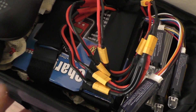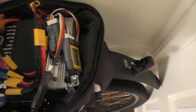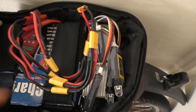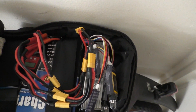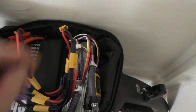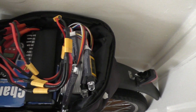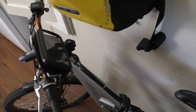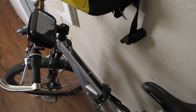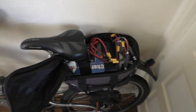This is my pack all strapped down and ready to go — very solidly mounted to the frame. I keep the cell checker wiring loose, and I don't like to strap down the cabling tightly to keep any pressure off the connections. I double-checked the voltage before hooking it up to the controller and it's still reading 49 volts. I'll be getting a handlebar camera mount to start doing time-lapse videos of my commutes. I've mobbed all over Portland testing this system out and it's working out great.